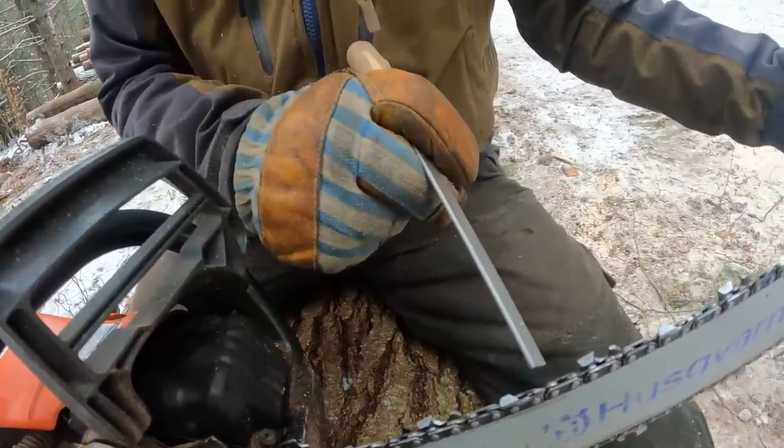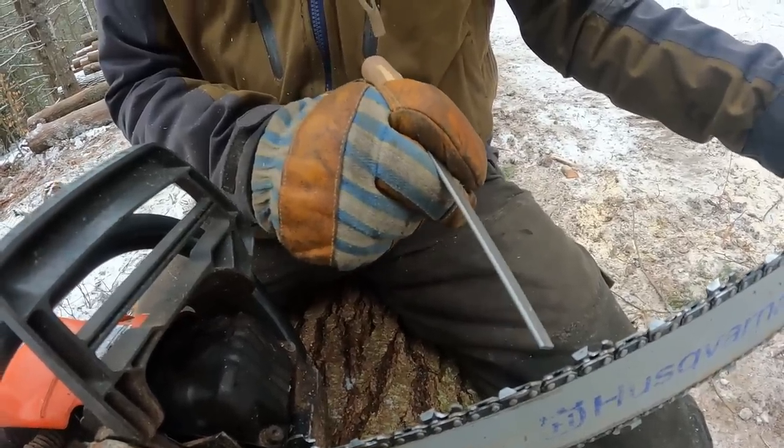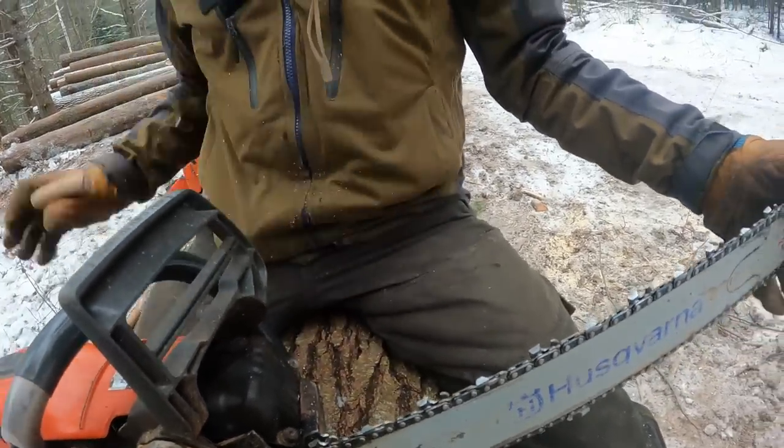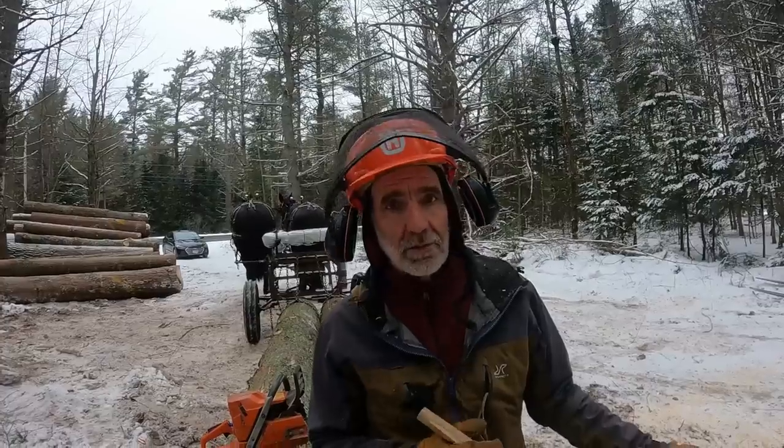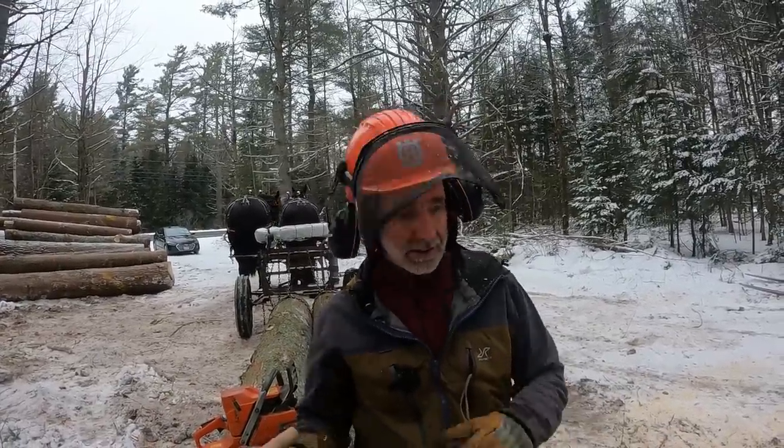But in the woods, when I'm in clean wood, boy, I like to have this raker down as low as I possibly dare without it causing troubles. And the troubles it causes, it will have tremendous more kickback, which makes it so much more dangerous. And hardwood is so much worse than softwood. Softwood, you can take the rakers down quite a bit more than you can in hardwood.